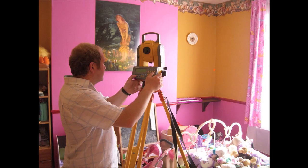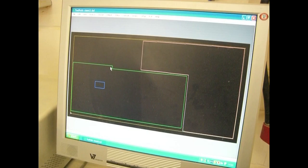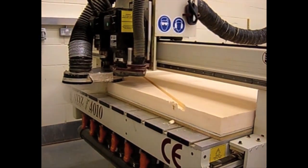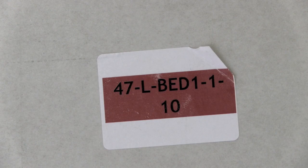The basic system is we use a laser measuring device to survey the elevation of the wall. From the information taken from that laser measuring device we can email that direct to the CNC cutter. He then cuts the board to the dimensions we've recorded, packages the board up, and sends them to site already cut and already prepared to put on the wall.